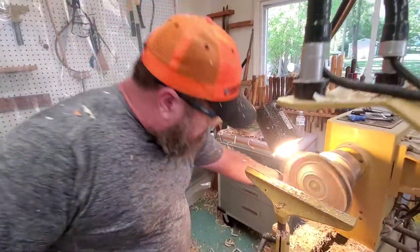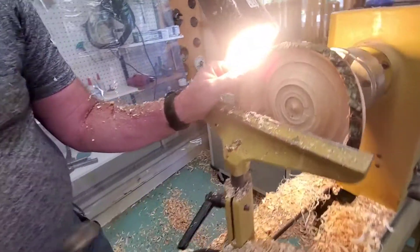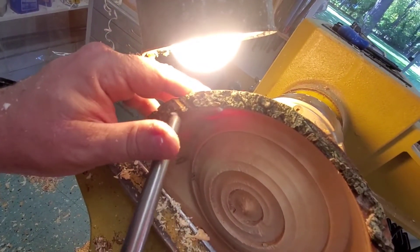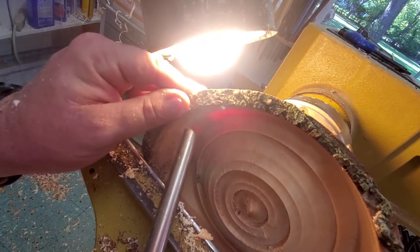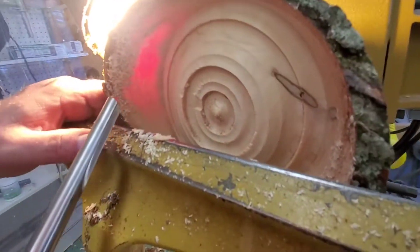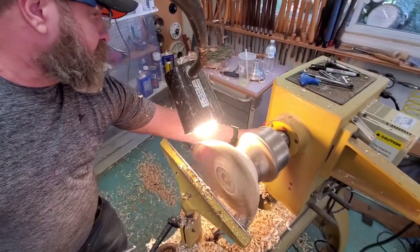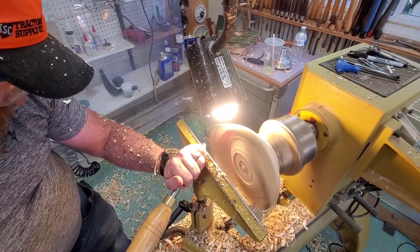You can see it's about maybe 3/8 of an inch thick. I'm going to take a good two-thirds of that off. The piece that I'm taking off is going to support the cut, and what's going to be left over is an eighth inch - and that should be an eighth inch throughout this edge when I get her done. So let's spin this up and see what we get. All right, here we go - here's the money cut.